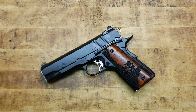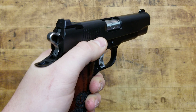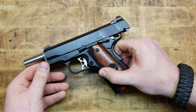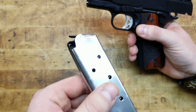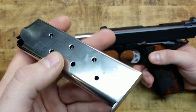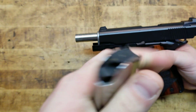Overall, completely impressed. The feel, the fit, the finish, the high-quality components — you cannot beat it. Speaking of the aluminum frame: traditionally, with an aluminum frame 1911 that doesn't have a fully ramped barrel, you could incur damage to the frame over time — the rounds feeding out of the magazine hit the aluminum frame while jumping into the throat of the barrel, and aluminum being softer than steel will wear more quickly.